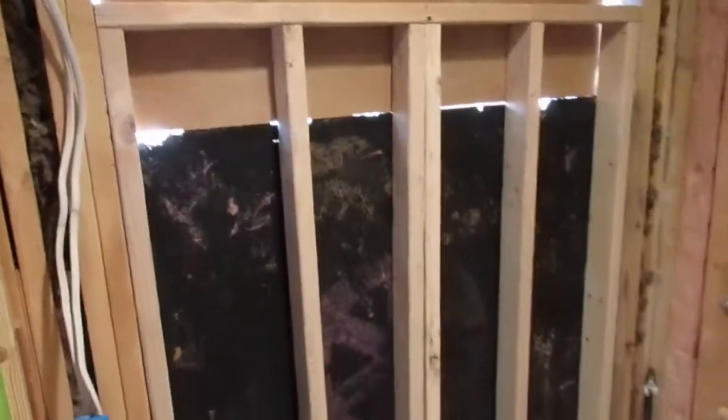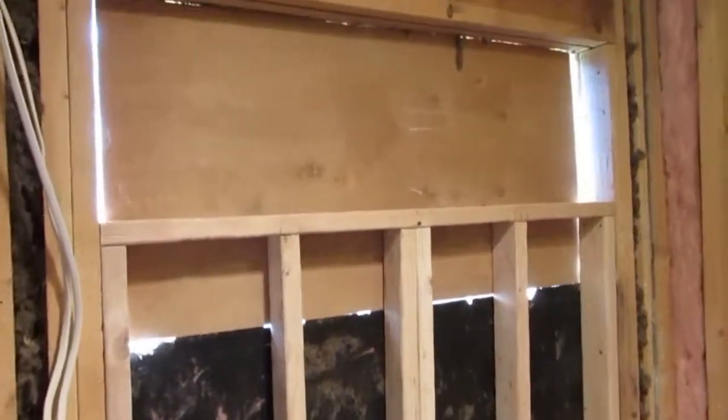Very much the same situation with installing glass block — if you go out and do installation searches you'll find guys putting it in like basement windows. It's old school but it's become new school and more popular, which is kind of where our heads are design-wise. They're using concrete, mortar, or some kind of concrete product to get these things to stick, and I want to focus on that because there's not a lot of information available. We have a pseudo interior/exterior installation — one is purely for looks, blocking the shower from the vanity — and then there's the exterior one. Last night I reframed all this and brought the framing up to the correct height for the window.